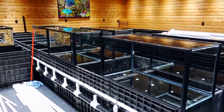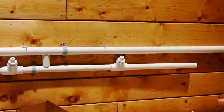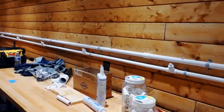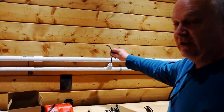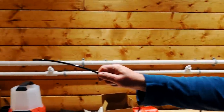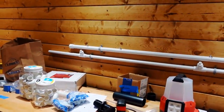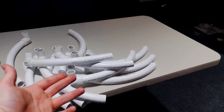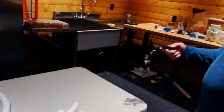We're also probably going to do some more backgrounds today. Dean explains: we had issues with a lot of air in the line — we feel like it's sucking air from the open solenoids that aren't hooked up yet. The water system going behind the tanks uses flex lines that plug into each one, running all the way down. The tubing is press-fit — also called RO tubing or ice maker tubing. We've left it capped on the end so we can add another tank or run water somewhere else in the future.